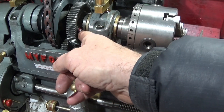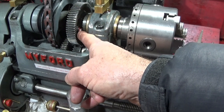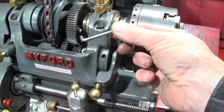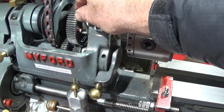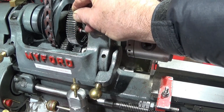You don't do that until you've disengaged the gear at the top here using this allen bolt. I used a shortened allen key which I just ground on the grinding wheel so I can actually fit it into the allen bolt head there.